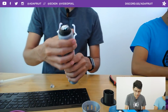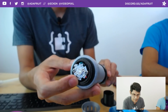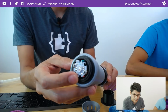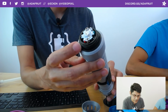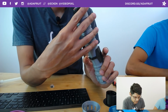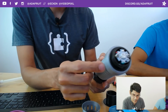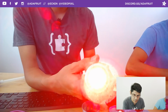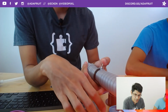The trick here was to figure out how to deal with the heat, because this thing gets really, really hot. That's what they're designed to be. They don't come with heat sinks, but the bottom of the PCB is aluminum, so it's a little tricky to solder. You have to do it pretty quick. So I have these two standoffs. It's hard to see because the coils cover it, but it hasn't melted yet because the standoffs are brass and they dissipate the heat, and they don't transfer down into this piece where the plastic is. Super bright. It gets hot. Eventually, don't touch it, even though I did.